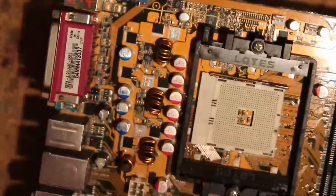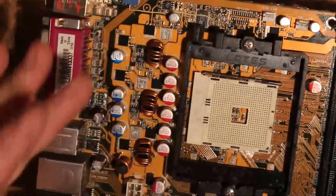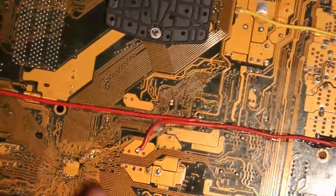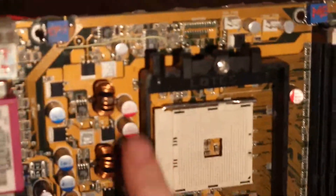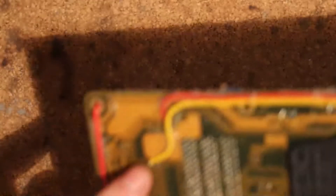But I don't think it's actually that necessary right now because ripple is pretty good for a board of that era. Back of it is the usual stuff. Those are the four caps I showed you on the top. Those four you can use either of them for measuring your chipset volts. CPU VCore straight from one of these caps — the whole row down here. Memory voltage I measure from up here.